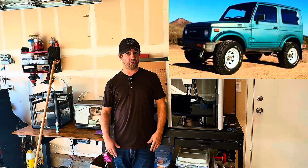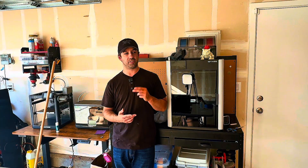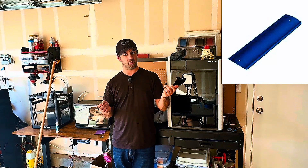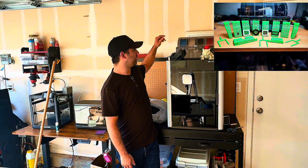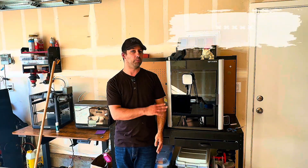To test this thing out, I'm doing three prints. The first is a radio bezel for a Suzuki Samurai that I have to print at a weird angle because of the clips, and it uses a decent amount of supports. The second is a battery cover — it's concave, uses supports, kind of thin, and covers the length of the bed. Third is the desiccant containers for the AMS2 Pro, which together make about a 14-hour print since I can fit it all on the bed — a good way to test long prints with ABS on this printer.